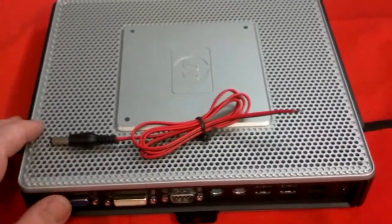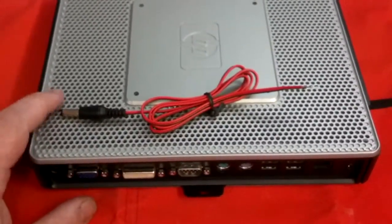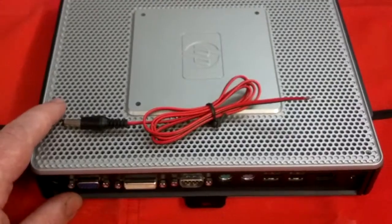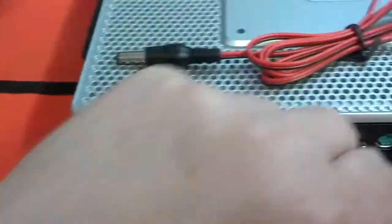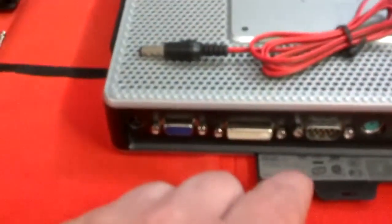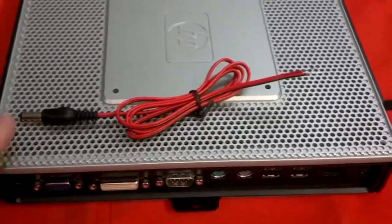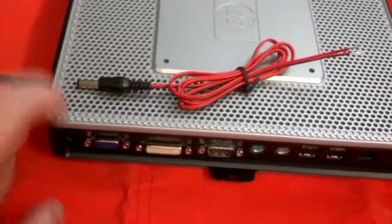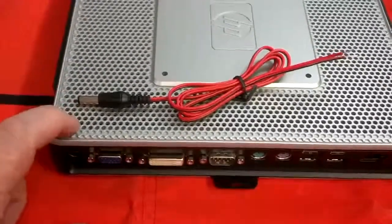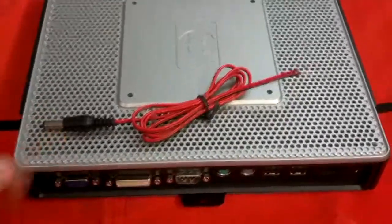I chose that mobile because it has a tape output on there, and that's what I'm going to be plugging in for some better quality sound. The scanner runs off 12 volts. This jack takes a 12-volt adapter. I've looked at the specs - it says 12 volts at 4 amps or so. The scanner has very little draw, really. So I'm going to piggyback this inside. I'm going to open this up and solder this in so that one power supply will power both my computer and the scanner.